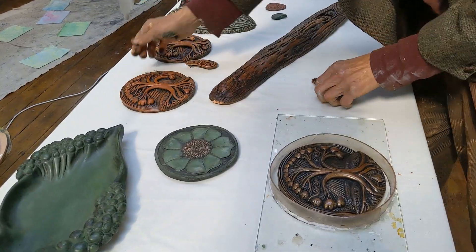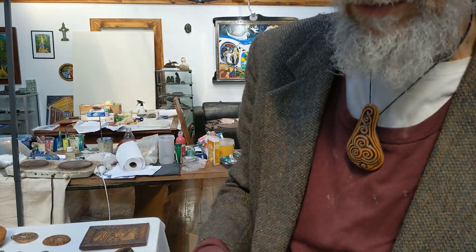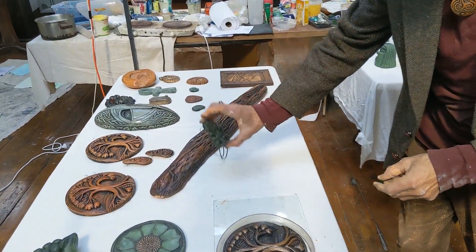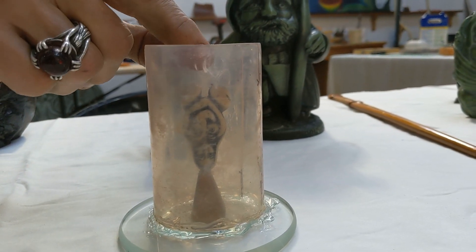One coat and it looks great, though it's obviously not as strong as the pendants I also make from cement. Those are made in exactly the same way except using cement and very fine silica sand with coloring. You have to wait about a day before demolding and cure for a week or two — they're more expensive to make but can be outdoor ornaments. The plaster ones are less durable — eventually the acid in rain gets to them and they start to get pitted.